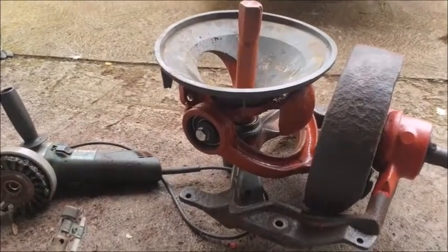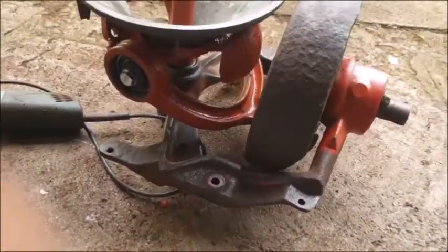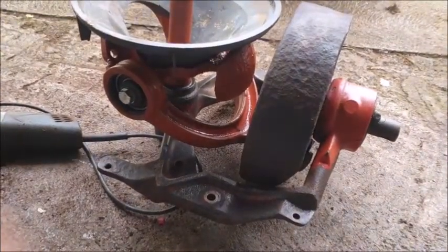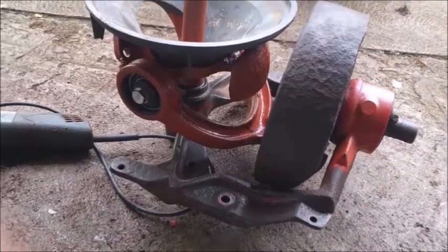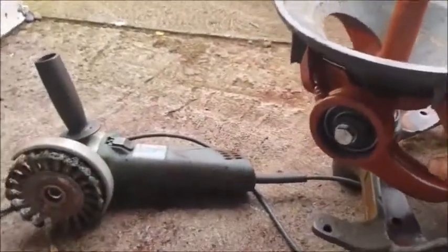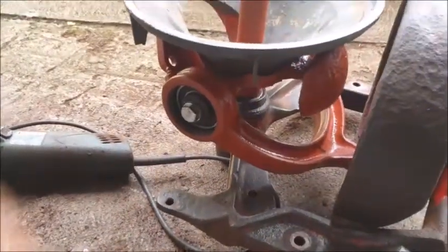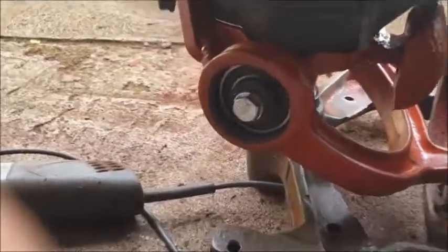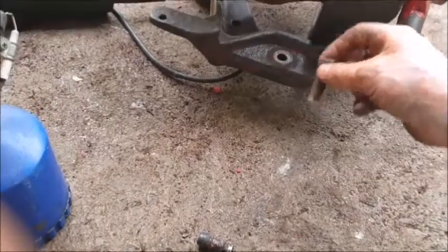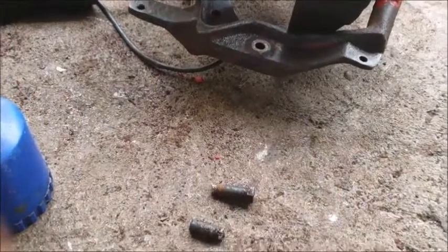Obviously the further I went, the more that needed to be done. I took the whole piece off the frame and cleaned it down. I was intending on painting it with Ultral and then a couple of coats of enamel paint. Anyway, all I managed to do was get three coats of Ultral onto the main part and the wishbone, if that's the right word for it. You'll see the new bearings in there. Even the bolts that were going through here mounting onto the frame were absolutely seized. So it was heating and beating, is all I can say — lots of it. Plenty of penetrating oil put on it, left for a few days. But as soon as you heat it and then beat it, you're kind of on a winner. You just have to stick with it.